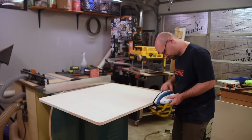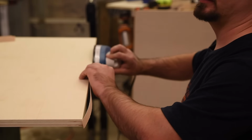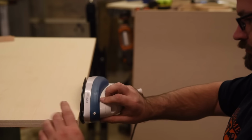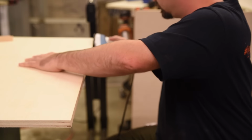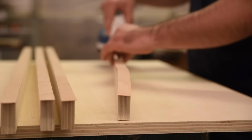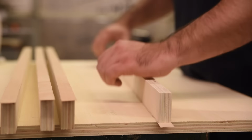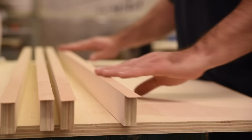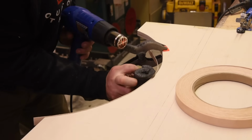This table will be painted and plywood edges just don't paint well, so I put iron-on edge banding on every edge that'll be exposed. That's a fast and pretty inexpensive way to get a much better paint job and also make a high-quality plywood hand-built piece look like it's just an impulse buy from a retailer that has groceries 2 aisles from their furniture.